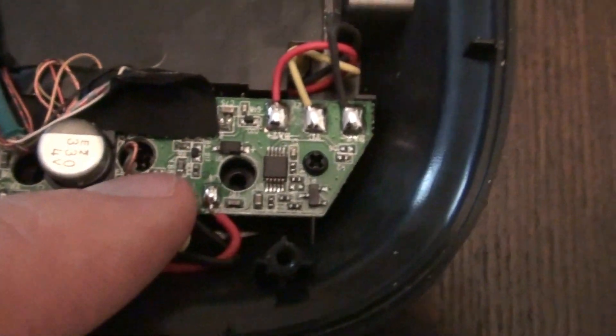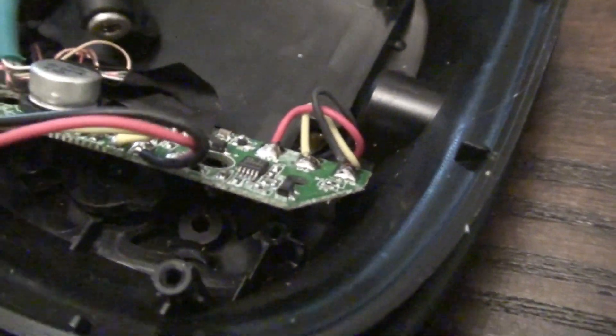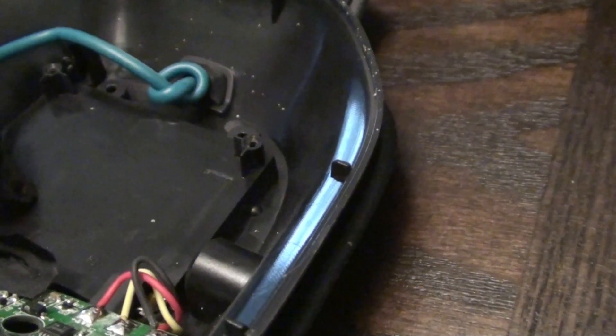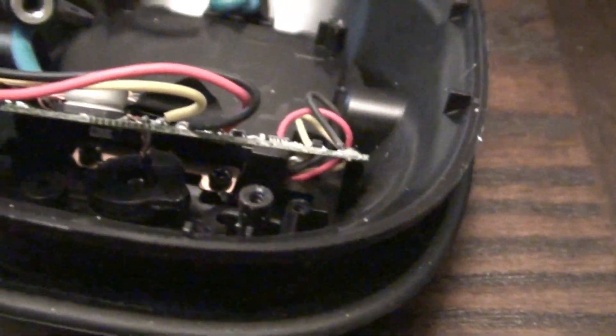When those four screws come off, there is one more center screw and that is what holds the microphone on. The best way to get access to that center screw is to remove the two screws holding the PCB board. Just to free things up, I did remove this side PCB board — it has one screw in it. That is where you plug in your mini-USB and the 2.5mm jack to get a little better access. There is a tiny hole in there and within it is the screw.